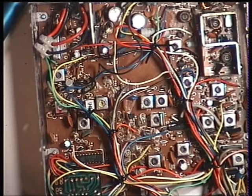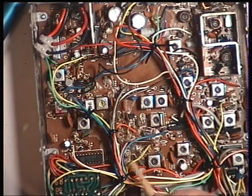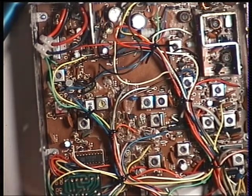So that set it up with the marker oscillator. What I've done is effectively had a second signal generator there on 455 kilohertz. Conversely, you could do it at 10.695 megs, which would actually be easier on the ear to do. But that's not what my marker oscillator does, so that's how I've done it. So that's now spot on frequency on receive. If you remember, we had to set the crystal on transmit and the delta tune circuit on transmit. And so I was just not quite sure whether it was going to be on frequency on receive. It was so minimally out that it wouldn't have mattered, but I've now set it spot on.